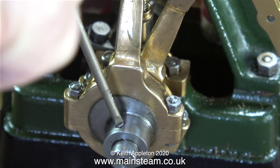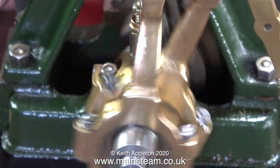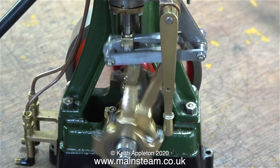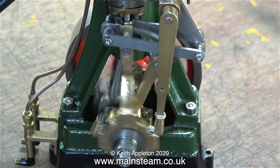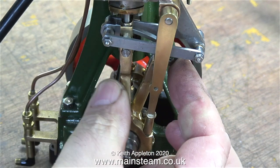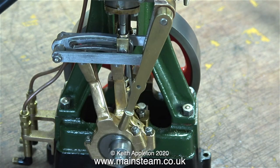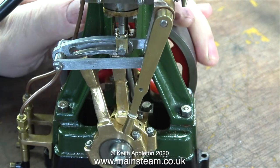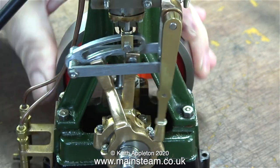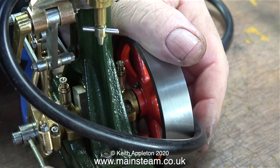It's time now to apply some compressed air to the steam inlet. As you can see, the engine runs okay — previously in this position the expansion link locked up against the drop arm. Now the engine should run perfectly in the opposite direction. Everything's very loose and moving about a bit, but it doesn't matter. It should still run in the opposite direction, but it isn't doing.